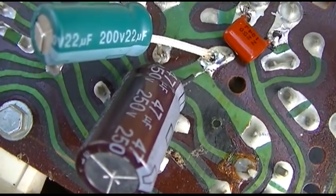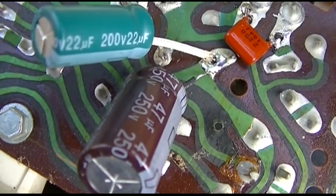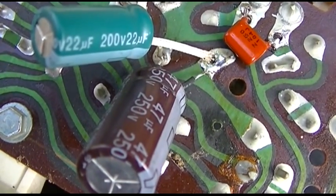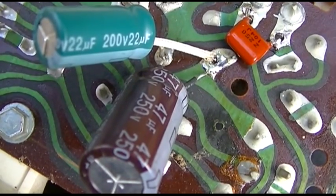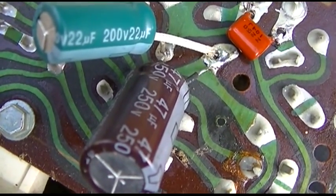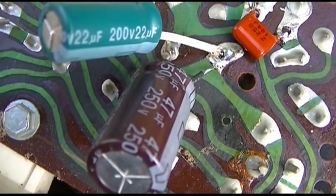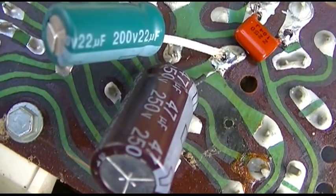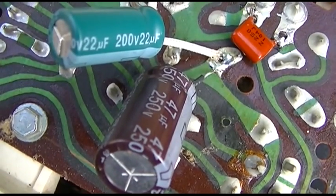Here are the two electrolytes and the line filter. I just tacked them across the bottom for this video and testing — I'll move them to the top a little later. One thing about these is they are polarity sensitive. You want to double check and make sure you get them in right or they will explode or leak. So let's power it up and see how they work.